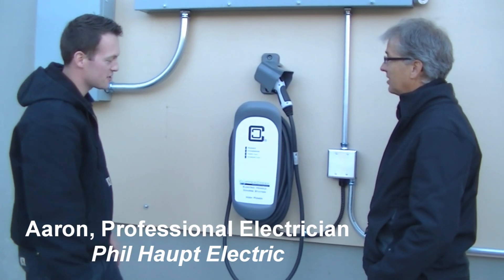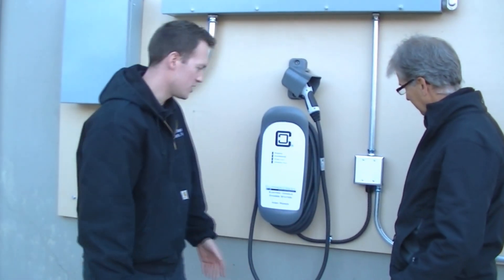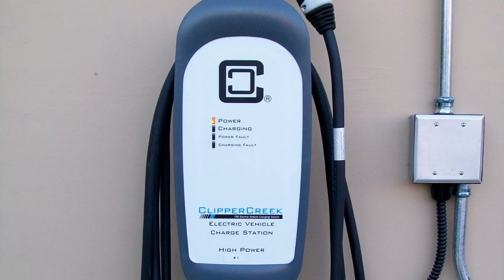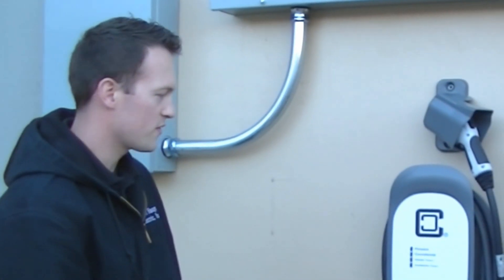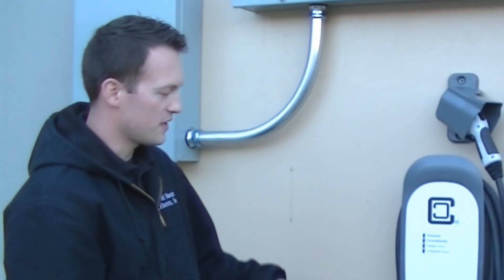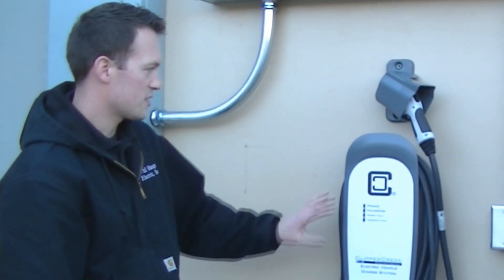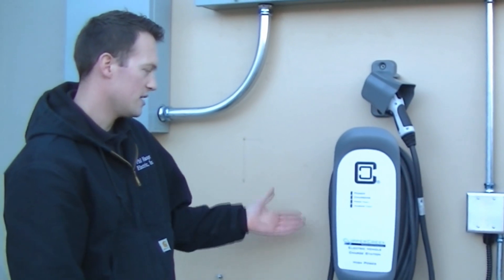I really like this application because the whip allows you to utilize the box that is already pre-installed in all homes now, generally within three to four feet of your main panel on the opposite side of your garage wall. If customers don't mind it being mounted within three to four feet of the panel, you have 25 feet of cord length to charge anywhere in the garage.